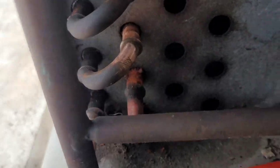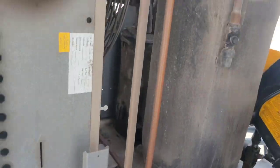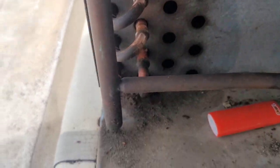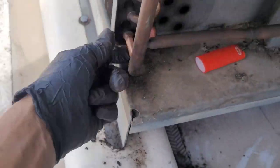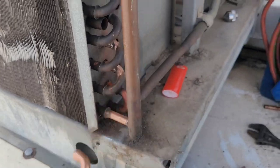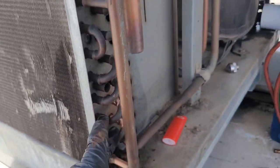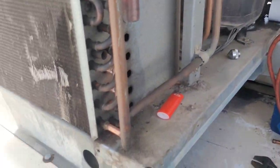I got that sanded as best I could. This is the plan: recover it, get it down to zero PSI, pull out this one and this one, unsweat this, pull it back a little, cut it with my tubing cutters, and then this is going to go right into there with the offset. I won't be able to record this part - I'll show you clips in between, but when I'm using the fire I won't be able to record.